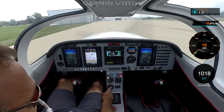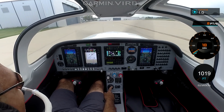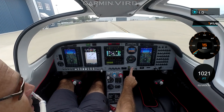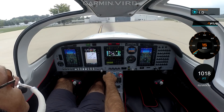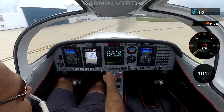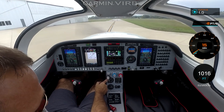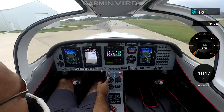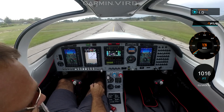Our hydraulic pressure is at 1500, which is perfect. That's what's holding the gear down. It's actually over center right now — it's not holding it down, but that's good pressure. You know it's working fine. We'll go ahead and bring our flaps down to halfway. That's what we use for takeoff — half flaps. Last time I flew it, about two times ago, I got a G meter down here. We pulled four Gs. We did a 360 turn at about an 80 degree bank angle. Did four Gs. And did negative three quarters of a G — I don't care for the negative Gs too much.